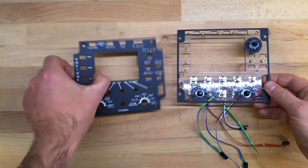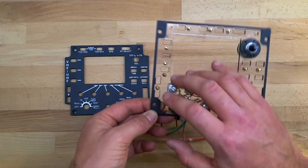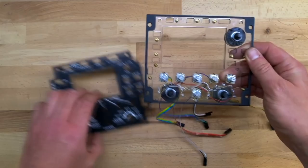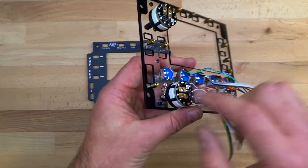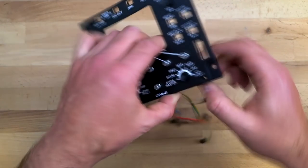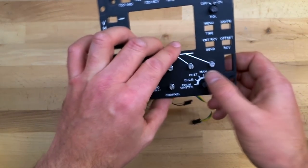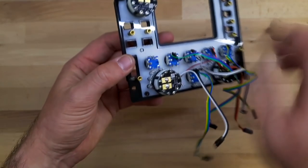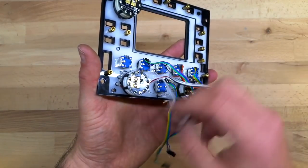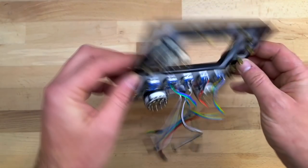Here are the two front-most panels of the ARC-210. You can see the faceplate has LEDs around the rotary switches, and there's going to be LED strip behind it - which is why it's clear - to light up all this section, all the buttons, and the top section. I originally did the whole thing clear with just LED strip, but the light wasn't well spread because of these large rotary switches. If you backlight the whole panel with just LED strip at a distance, the light won't get in behind these, causing a dark shadow. So I did a hybrid setup with individual LEDs tucked underneath and around the rotaries, and the rest is done with LED strip.